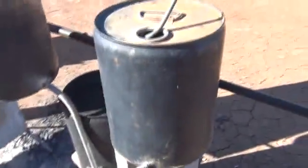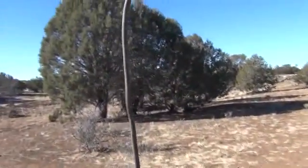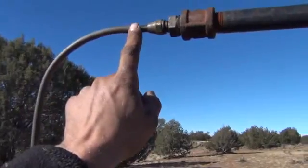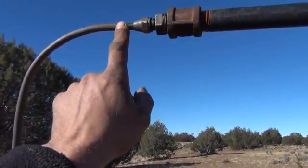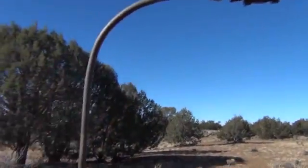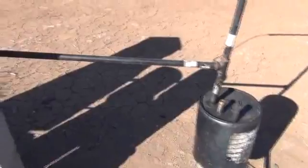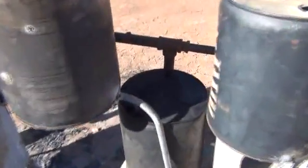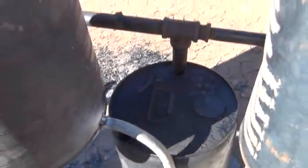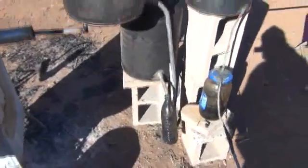So it comes up out of there into our first major condenser here. It goes through another section of copper tubing. Now you have to make sure the copper is running downhill. Otherwise the wood wine will be produced the second the synthetic gas hits it and will roll backwards. It won't want to go through unless it's on a downhill slope. So once again, we're through the fractional distillation center here into our second catch. In the background you see our very first catch. That's the heaviest of the bio-crudes, which we'll be running today. You can see a little pull-off spot there at the bottom.